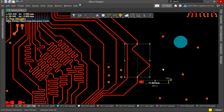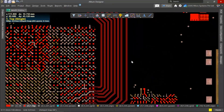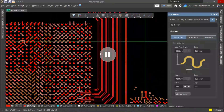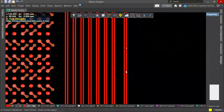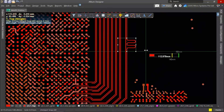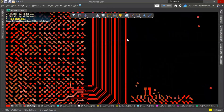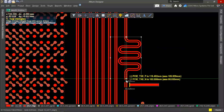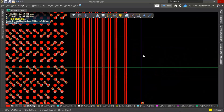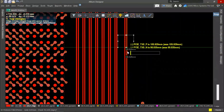Like this, you can do tuning for a single-ended signal. You can also do length tuning for a differential pair. Hit Tab to switch to accordion tuning for differential pairs and select the net. You can do the tuning for differential pairs, pressing Spacebar to get different style patterns. We can also do trombone tuning for differential pairs where there is a space constraint. Those are the tuning pattern features.